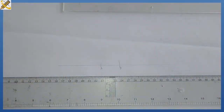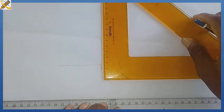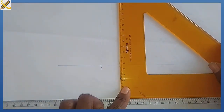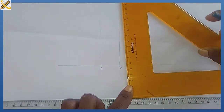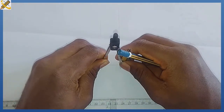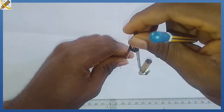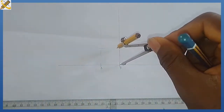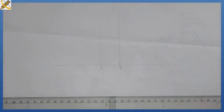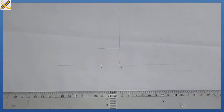For this pentagon I'm going to be using the square method. The very next thing is to produce a square. From mark A I produce a vertical line; from mark B I produce a vertical line. With my compass I pick length AB, then with length AB I strike an arc at the top from point A, and with the same length AB from point B I strike an arc. Then I join those points — now I have my square.